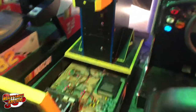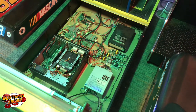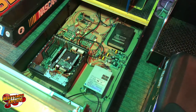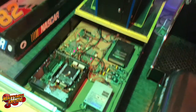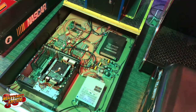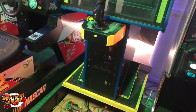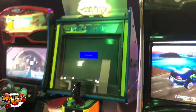Like many of the other ones we have, it needs a battery. It needs a battery on the motherboard. I stole it out to fix one of the other games while it was dead. And now that I have it ready to work, I need a battery. So it's getting no signal to the monitor, obviously because there's no battery in the PC. It doesn't know what settings, what resolution and stuff for the monitor to be on. So I'm done with that for now.